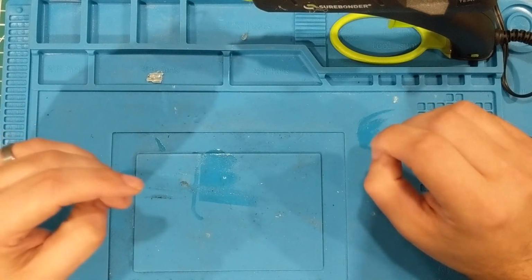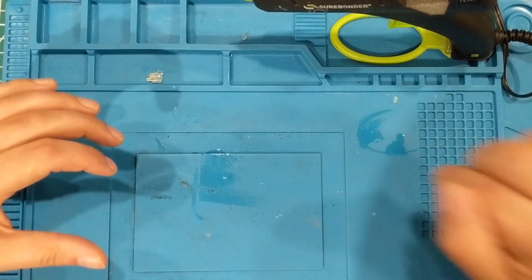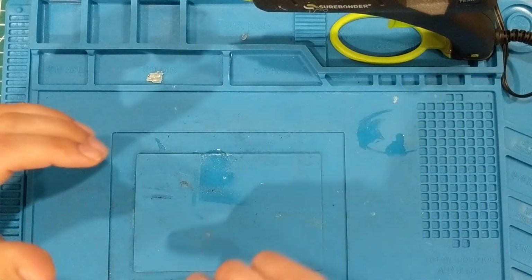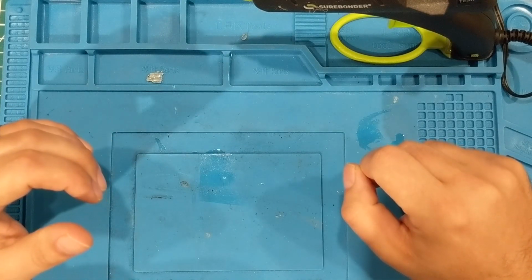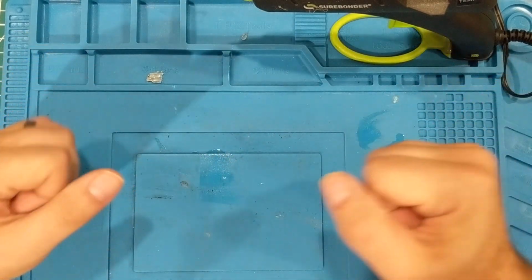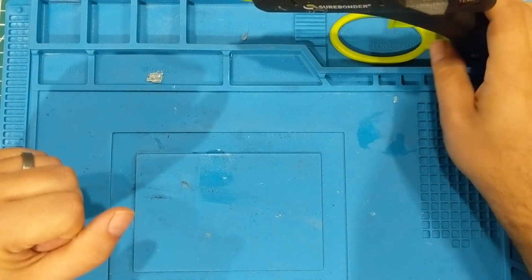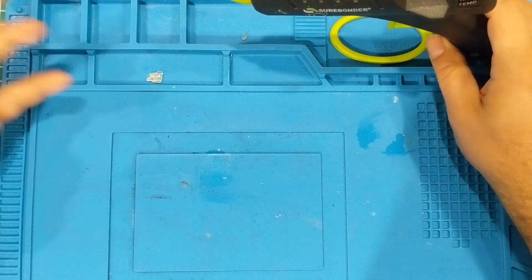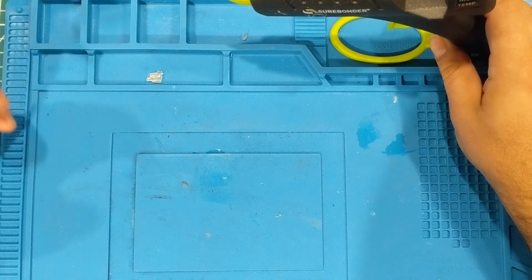And so a lot of times what I will do is I'll take a sacrificial piece of board, and instead of putting little nail holes into the part that I'm going to see later, I will take some hot glue and hot glue the bottom of it. And when I do that, I'm able to have a completely clear top so that I can just route the bottom and know with pretty good certainty that that thing is going to stay when I'm working on it. So those are my favorite glue tips for makers.